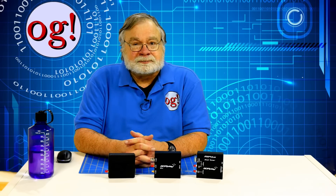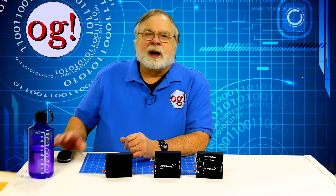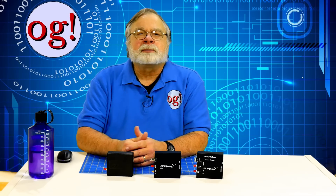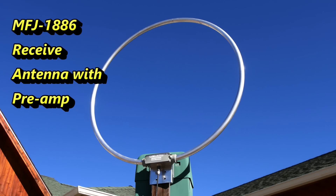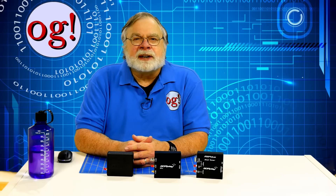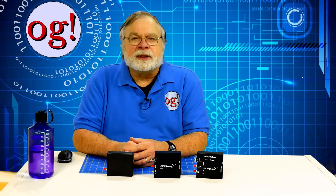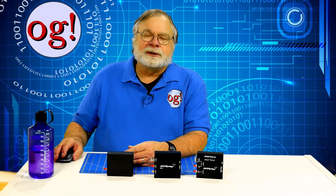It is possible to select multiple signals for demodulation at the same time. Before we dig into the features of the new RSP-DX receiver, let's see if you're in the market for this. I have long used my SDR Play RSP-1A as a standard part of my station in pan adapter and general coverage shortwave listening duty. I have a wide band HF receive antenna, the MFJ 1886, which I reviewed in Ask Dave episode 67. My Yaesu FTDX 3000 transceiver has an RF output that is a buffered version of what the antenna hears on the band I'm operating. I almost always turn on the SDR Play receiver and watch the entire band on my PC, which provides a much better band scope than the one on the Yaesu display.